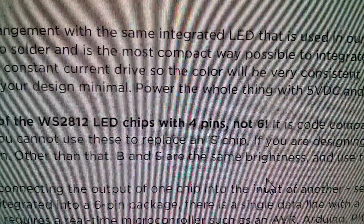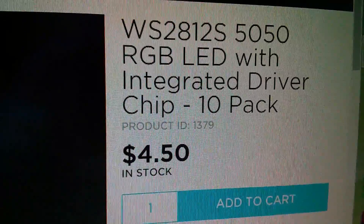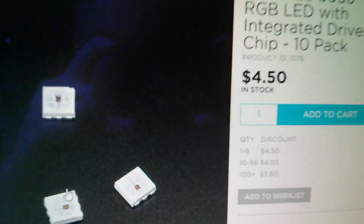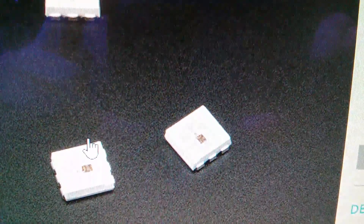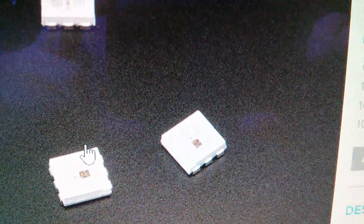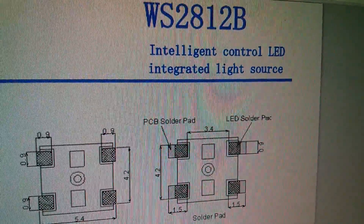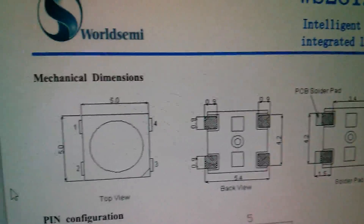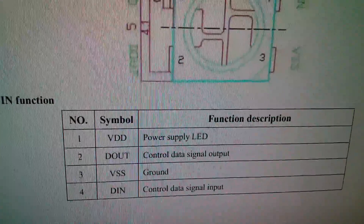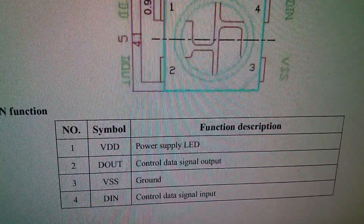What's a WS2812S? The WS2812S is also a 5050 chip with integrated driver, but you can see from the picture that it has six pins. Looking at the WS2812B datasheet — it's a four pin device, a WorldSemi chip. The pins are VDD, data out, VSS, data in. Nice and simple.